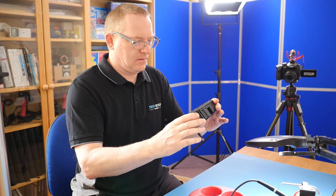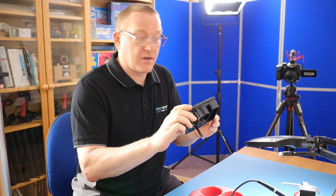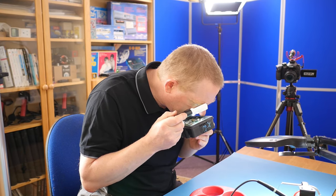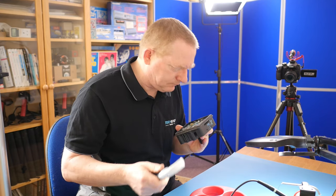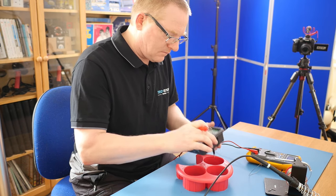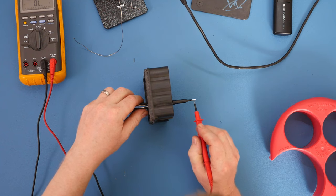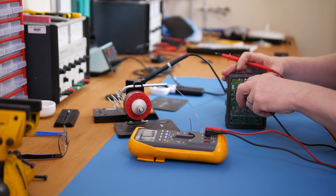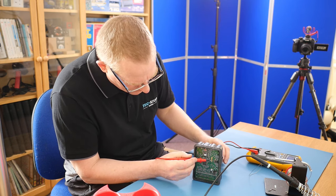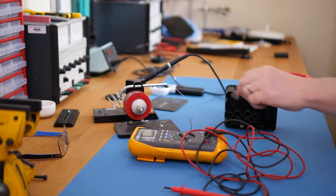That's all done and hopefully all soldered. Just before I call it a day, I'm going to stick a big magnifying glass up like a monocle and check for any dodgy soldering — and it all looks okay. I'm now going to test the continuity of the two pins that go to the motor or pump. Because they only push-fit in now, I don't really want to solder those because they could be liable to fracture if the car hits a pothole. I've got continuity there so those two connections are probably okay.